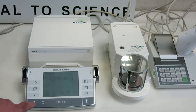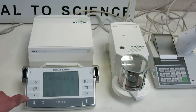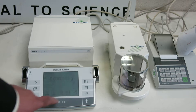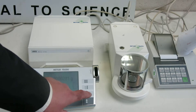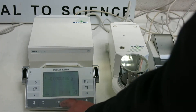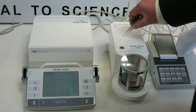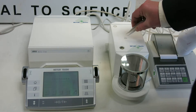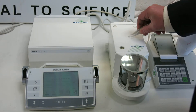You can see here that the weighing pan, this is the sample introduction here — you can see the movement there, it's nice and smooth. What I'm now going to do is put a little sample on there; it's a small stapler as it happens to be. What we're now going to do is just tare it and we'll now place this on the balance itself and we're just going to weigh it and pick it up.